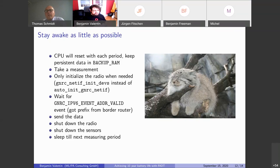Okay, the second question was, you said that some of your components can actually run from a lower voltage, and you can power them directly from the battery. So is it feasible in that case to bypass the buck converter or linear regulator inside of the SAMR? No. These voltage regulators are the reason why they can run from this range of voltages. Okay, so it's for the step up. Yeah, because some support lower voltages actually, so you can save energy if you just provide them with the lower voltage if the CPU continues to run at that voltage.